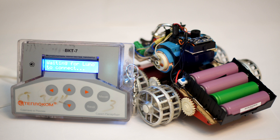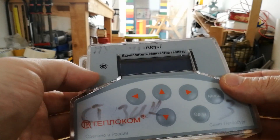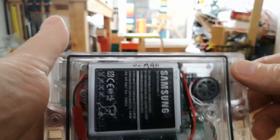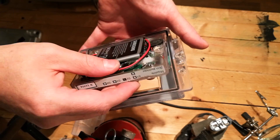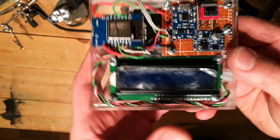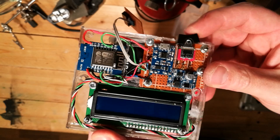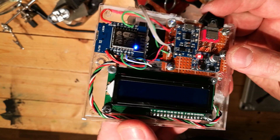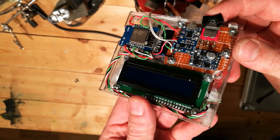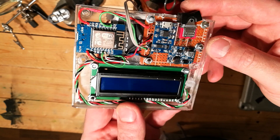Let me briefly show you how I set up the hardware. Starting with the remote control: I used an old box from an industrial heat regulator. I've integrated a recycled switch as well as a charger via a micro USB socket. Inside there is a battery from an old smartphone. All the main components are soldered on the reverse side. At the bottom there is a cheap LCD screen connected through an I2C interface. Top left is the Wemos D1 Mini with the ESP8266 chip. Top center is the TP4056 battery charging controller. And on the top right there is the switch and a 5V step-up converter below it.